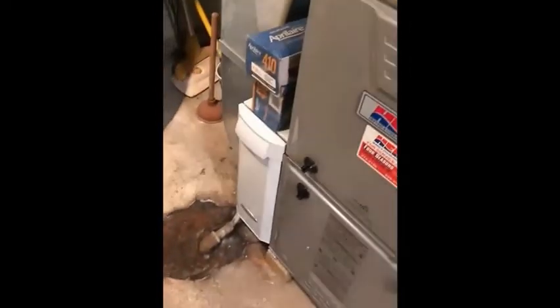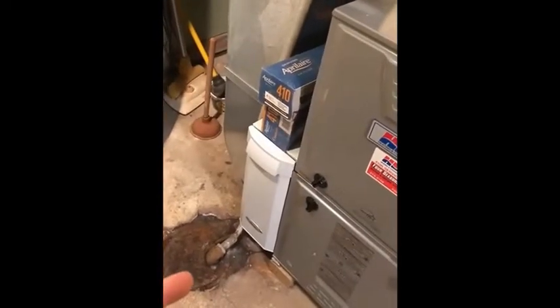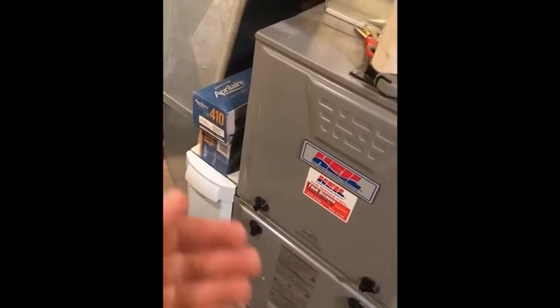That's great. But when you look at that furnace filter, it has to have a cover on it — a tightly fitting cover — because if it's open, it's sucking air in. And if it's sucking air in there, it very well may be causing your water heater to have problems establishing draft. So look at the return side of your furnace, note where the filter is, and make sure there's a tight-fitting cover so you're not causing low pressure in the combustion appliance zone, which could interfere with the draft of your natural draft water heater.